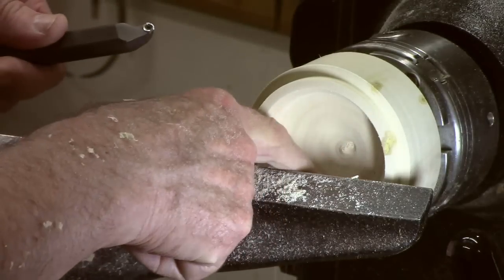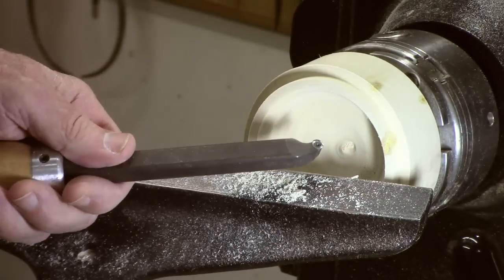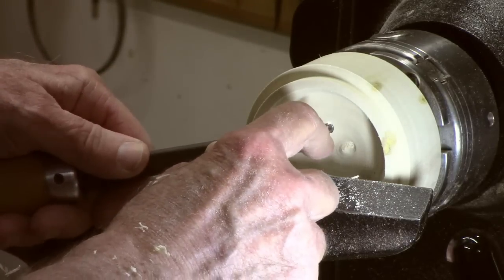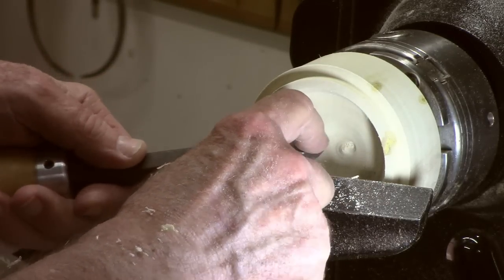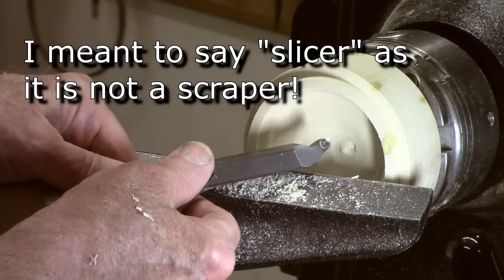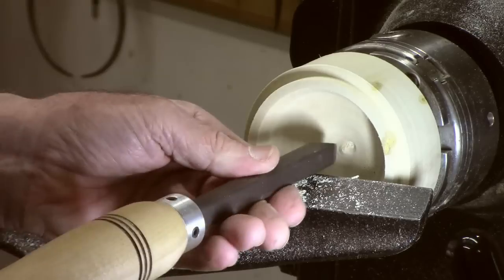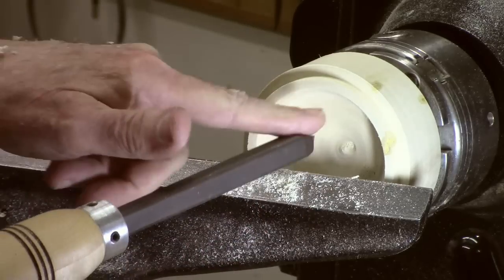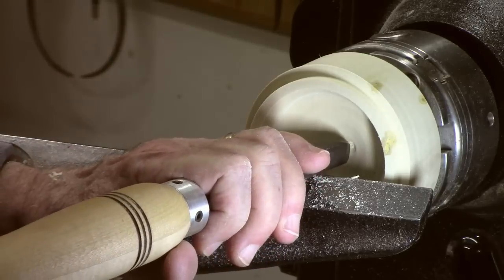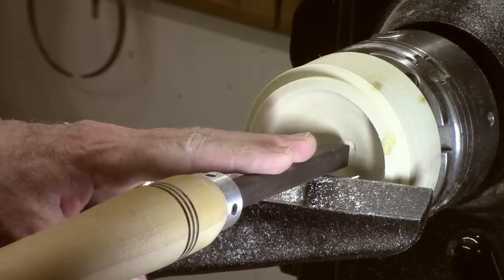Getting just a little bit of tear out in here, so I want to get as smooth a surface as possible. For that, I really like this Hunter nanocarbide cup scraper. This is not anything like your flat, easy wood tool. So if I can get you a little close up of that. This is already at a dropped front with a very slight angle, so it has exactly the angle that I need to come in there and make this cut, cutting with the tool just about flat.